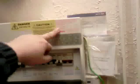This is an image of a newly installed consumer unit, installed today, 6th of January 2010. The certificates that must accompany this change are waiting for the customer when she returns home. We have an MPS Electrical label here stating today's date — 6th January 2010 — when it's been inspected and tested, because every circuit has to be inspected and tested. We recommend that the board gets inspected and tested again in 2020. It has a two-colour warning label stating that there is red and black, and brown and blue coloured cabling within this distribution board. We also have a warning voltage sticker and some additional information for future electricians should they come and need to do some work in this consumer unit.